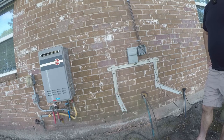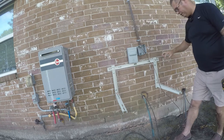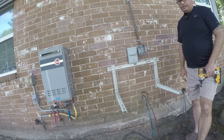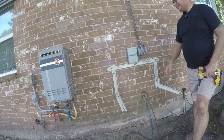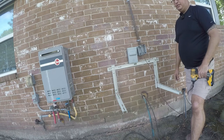What's left to do is to bring the unit out here and set it up, and then I'm gonna bend these and bring them up to where they need to be for the connection. This wire will get replaced with communications wire. It's for mini splits. This is thermostat wire, which isn't right. That's abandoned in place because we're not going to use it.